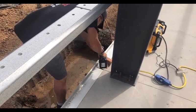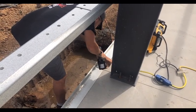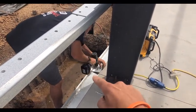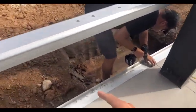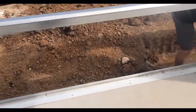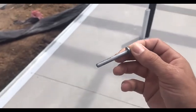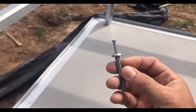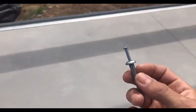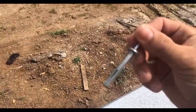He's going to use this cordless drill to get through the steel, then use his concrete drill. On the ends or the laps, we want to be two inches from the edge, then 24 inches on center — you can also go 20 inches. These are really inexpensive, about 25 bucks for a box of 100 from Home Depot. You can use a different anchoring method; we don't specify what type of anchor to use. You can use concrete screws, but we really like these.